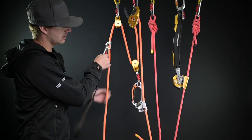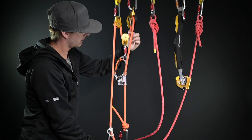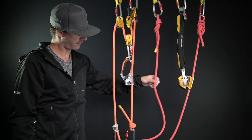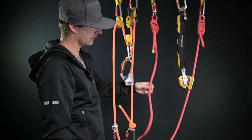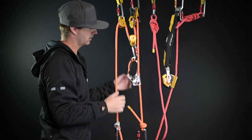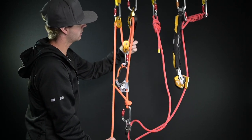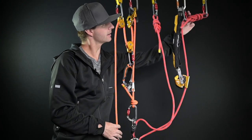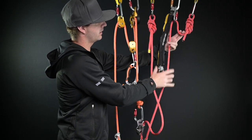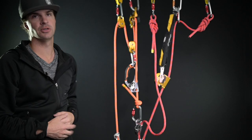Let's see how this operates. Keep in mind this is not a very heavy load — this is for demonstration purposes only. I pulled that down, locked that handle, and I've effectively replaced that line. Now there's some slack, so I want to pull this up and protect my backup. Clip that in, readjust, unlock the handle, and continue hauling. I can just pull down on the back side of that. As per manufacturer specification, this carabiner up here is required — this rope must run in line with the shock pack, so don't forget that.